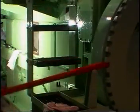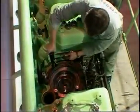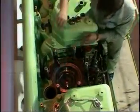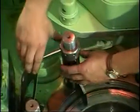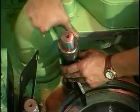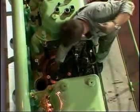Turn the crank throw concerned to a position approximately 50 degrees before top dead center. Clean the threaded hole in the top of the piston. Mount the tool for holding down the cylinder liner. Mount the lifting eye bolt, hook on a tackle and haul tight.